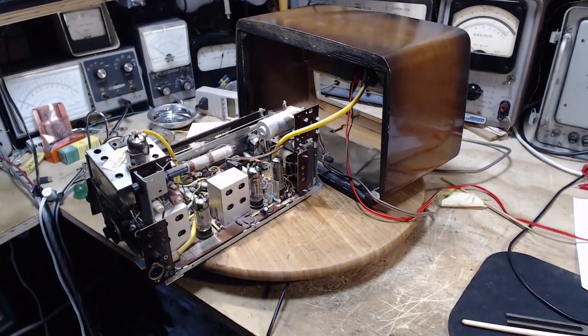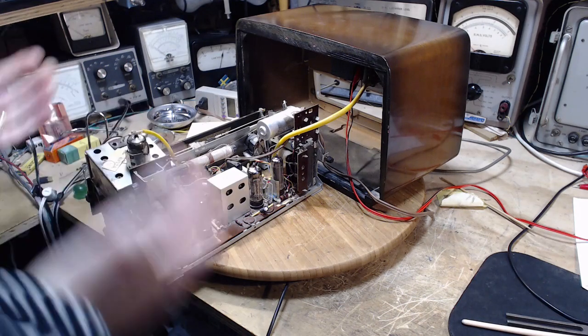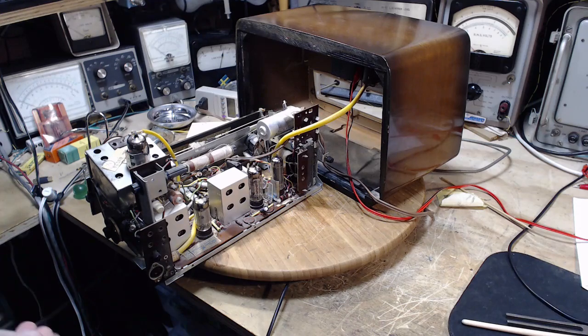So, what am I going to do with this radio? Oh my gosh. I'm halfway through doing basically a standard repair or simple restoration on the radio, changing capacitors and that. And I've encountered tube sockets that appear to have some inherent problem in the socket itself. Am I absolutely convinced of that? I'm like 95% convinced of that. Could it be something else?